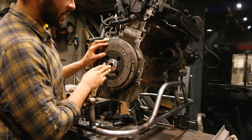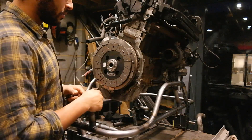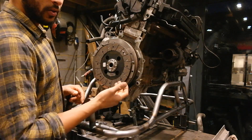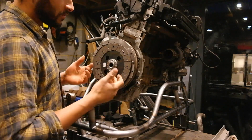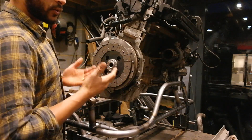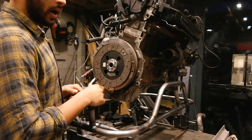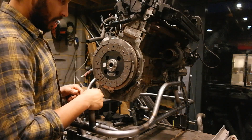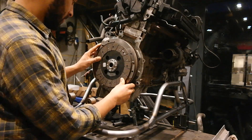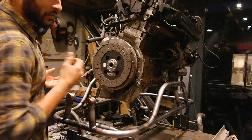This clutch will allow you to rip the R380 into pieces in theory, so we'll see how it holds up. The R380 is supposed to be rated to 380 Newton metres, but with these things you never know — you could break it at 300 or it could withstand 500 if you drove it sensibly. I'm not too worried if something goes wrong with the R380; if it shears some gears or breaks a shaft I'll start looking for a BMW six-speed box, which would be a good match for this engine. But I couldn't find one anywhere so I was kind of forced onto this route anyway.